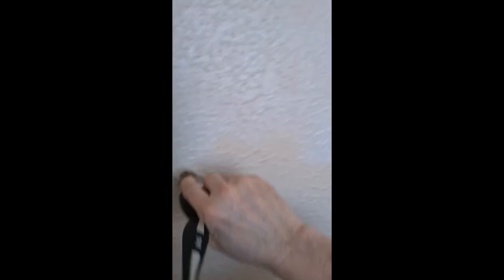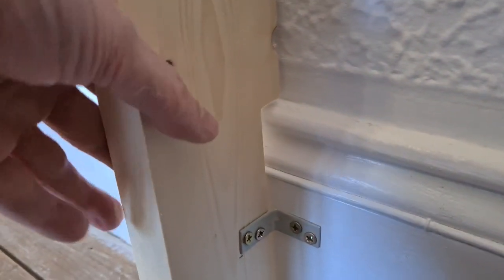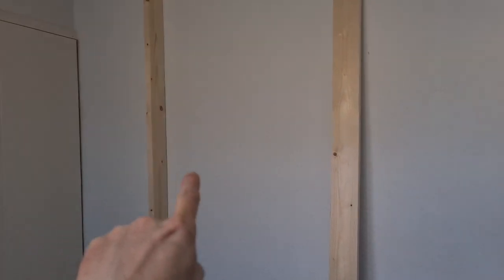I want to put two or three coats on this wall in preparation for putting the wood up — worst job in the world but it's got to be done. I've put the brackets there now — you'll notice it still moves a touch, and I've put some brackets down at the bottom. I've also had to notch out a bit of wood because it won't sit flush on the skirting board, otherwise it wouldn't be straight. I've got the middle one there because I haven't put it up yet — I was still working out exactly where it's going to go.